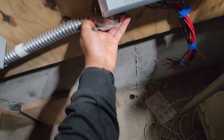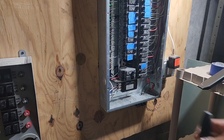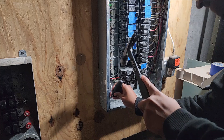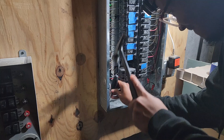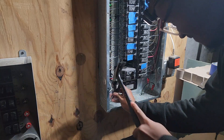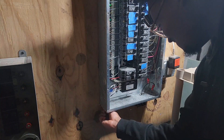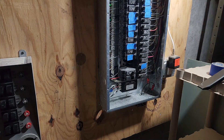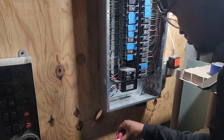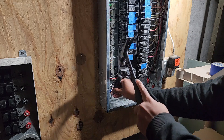With our plug, our knockout lines up with that hole. So I'm going to knock these first two plugs out and get our knockout knocked out — just get a little hammer and tap it on out. Make sure you don't hit any of your wires. I don't think that'd be the right size, so I'm going to have to knock out one more ring — maybe two. There are multiple rings in here to knock out.